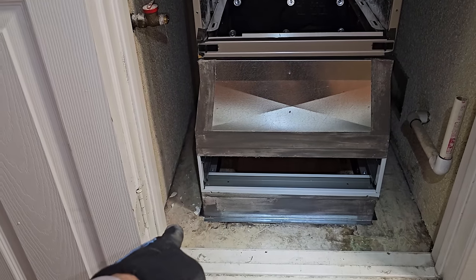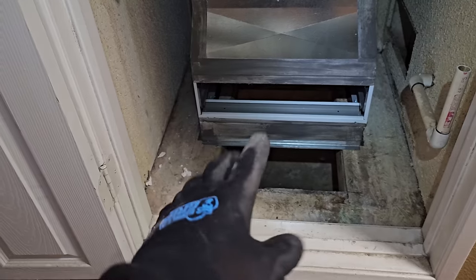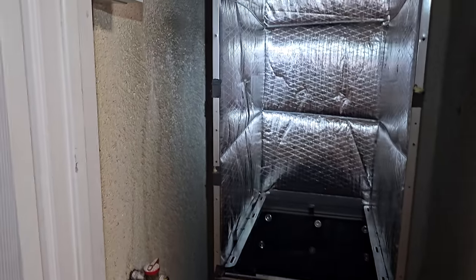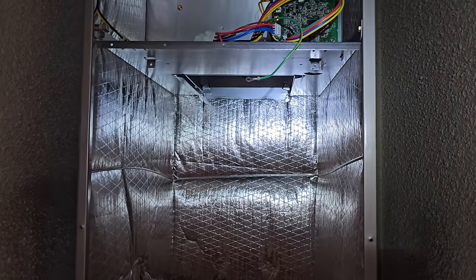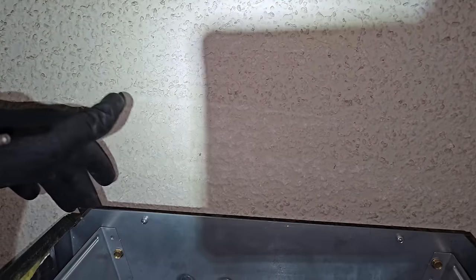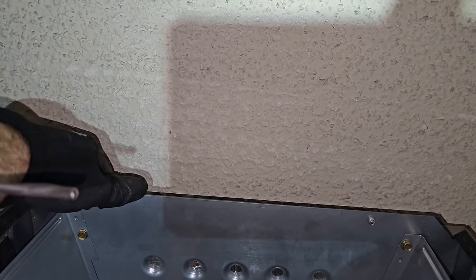And that's going to come up another 3/4 of an inch if I set a piece of plywood on top of that. I have to fill this. So this is basically pushed back as far as I can go. And that just opened up a crap ton of space. I can actually get my head right in here and get back here. The plenum sits on top and it's flanged, so I'll be able to mastic tape it or something. I haven't figured that out yet.